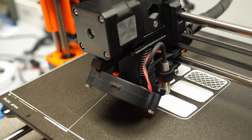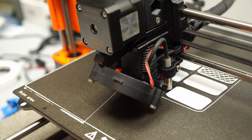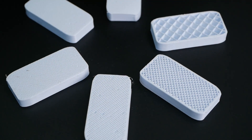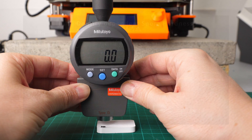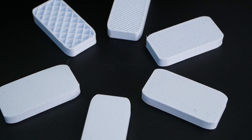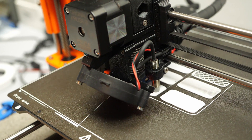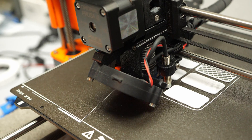Let's also quickly take a look at a way we can vary the softness of materials with simple slicer settings. 3D printing allows us to print parts with variable amounts of infill, which results in variable hardnesses for TPU parts. I printed samples with different degrees of rectilinear infill in Extrudr's medium TPU and measured the Shore hardness. Shore hardness A and D decreases with lower infill values, especially between 30 and 10%, reaching a softness almost comparable to the maximum foam VarioShore TPU or Diabase X60. Though, this method is not always feasible because wall thickness and orientation will affect those values quite a bit, and different infill patterns will give different results.